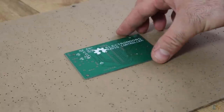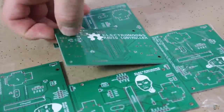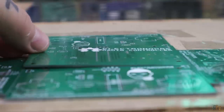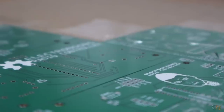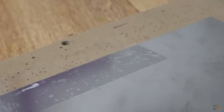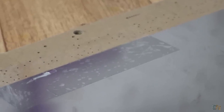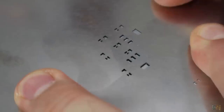I've used the wood board it came with as a support. Now I place my PCB in the middle and using other boards around it, I fix it in place with scotch tape. The boards that you use must be almost the same height as the PCB, otherwise there will be a small gap between the stencil and the PCB and that might give you some problems. Now my PCB is in place and I could take it out and put another when I'm done with this one — this will spare me some time when soldering many PCBs. I put the stencil above the board and move it until I perfectly align it with the component pads on the PCB. Then I tape the stencil on the top side so it can open just like a door and allow me to insert the next PCB. I also put some tape on the side so it won't move when applying the paste.